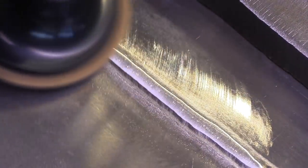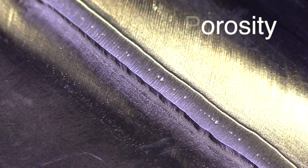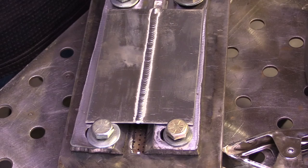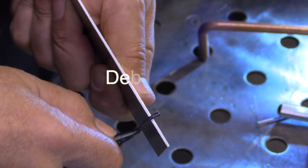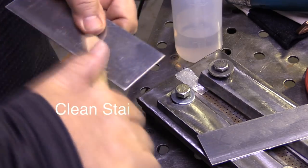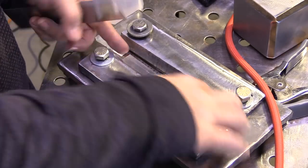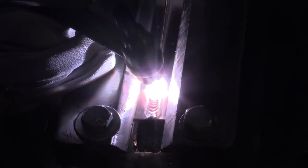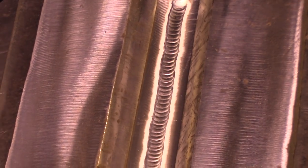So I'm using a brown Scotch-Brite disc — a Rolox disc on a little grinder — and I'm knocking off the surface. Then I'm putting on a finer grit Scotch-Brite and you can see that linear porosity just kind of jump out at you. It's in a straight line — that's what linear porosity is — and the tolerance for linear porosity is pretty strict in most welding codes, a lot more strict than scattered porosity. So I'm cleaning the edge now using a deburr tool; you can also use a nice clean file, or both. Then I'm doing a little wire brushing with a clean stainless steel brush, and then wiping it with acetone. I'm not going overboard, I'm not cleaning this like my job depended on it, but I am cleaning it fairly thoroughly. I'll just show a little bit of the arc shot here — it really doesn't look a whole lot different than what the last one did. I'm trying to use everything the same, a tapered electrode on each weld test joint, except that this joint has been fairly thoroughly cleaned.